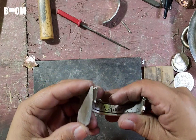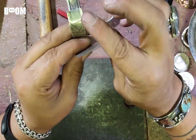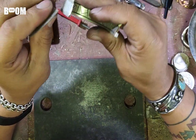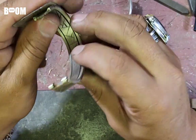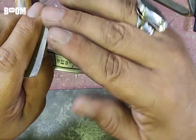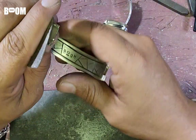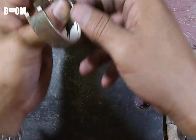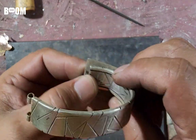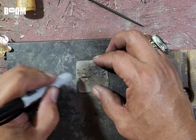Alrighty, Juanitosville, here we are. Guys, this is what I'm looking at. Now you can see the groove that I got in there. I feel pretty good about that. This is the sheet that we just rolled, and I'm trying to mock it up. I think I'm going to have the tip of this bent over to keep the wire from coming all the way through. But I'm going to give it some extra play on both sides, because the dome is going to take a little bit of the length away. So I'm just going to cut that out.